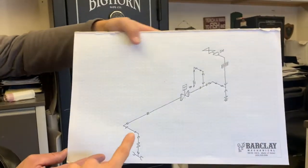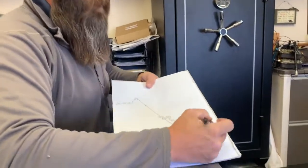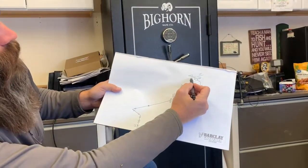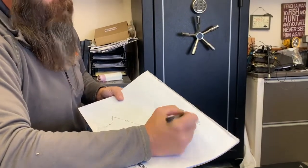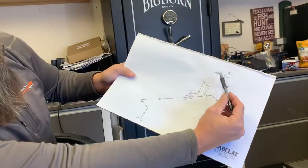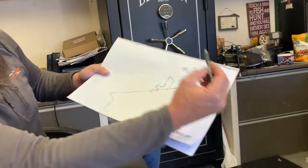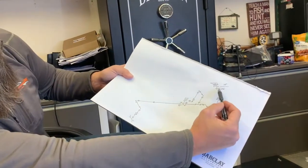Typically right here I would write 'TP' because that's a tie point — this would be our tie point to our pressure vessel. This bow tie symbol represents a valve; technically since it's a ball valve it would also show the ball and handle orientation. We'll have a 2x1 reducer coming out of there — this side is threaded — and then we're going to add a 90-degree turn down, shown as a socket weld 90 with the two little cups.